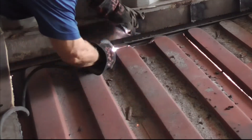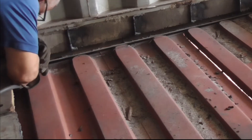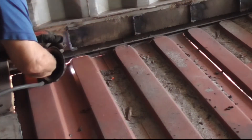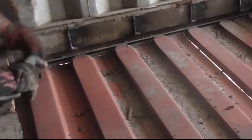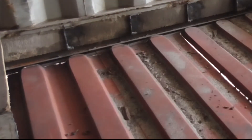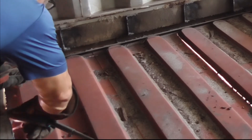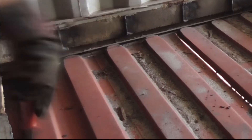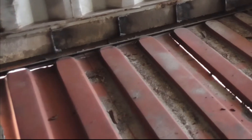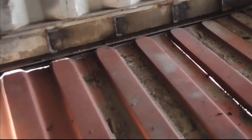I cut as close to the wall as I could. You can see there's a straight line at the top but underneath there's still an extra inch, maybe inch and a half of metal sticking away from the side of the wall - I'll cut that the next day, a lot easier on a ladder doing a straight line right against the wall. To break the panels loose I use all kinds of things - the pry bar or heat - but it doesn't take too much. When cutting with the plasma it seems to glue itself back together if you go a little too quick, so the pry bar helps break it loose. The bigger ones you still have to cut through with the plasma cutter and I'll go back and hit them a couple times, then you'll see the panel just disappear in the time lapse.